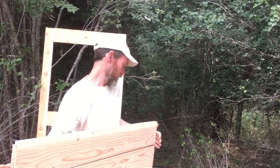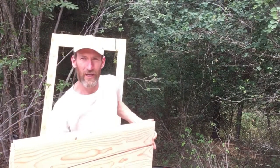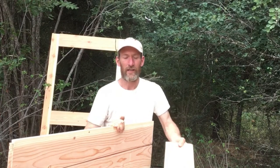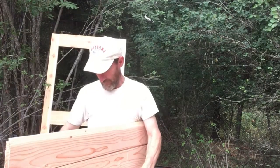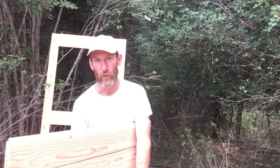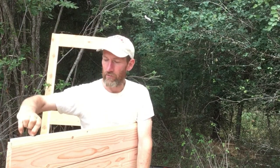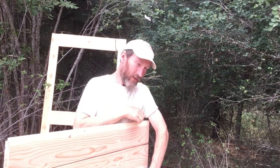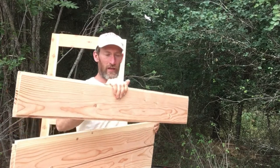Never made a very good door. We made a door for the barn last year and it looks okay, but you know, it didn't weather very well. We used wood that was really green, didn't give it a chance to really dry out. And so it shows. One of the things we're doing in this door is in between each groove, we're putting in little rubber bumpers so that the tongue doesn't quite fit all the way into the groove on each joint. That'll give it a little room to expand and contract as the weather changes and the humidity changes.